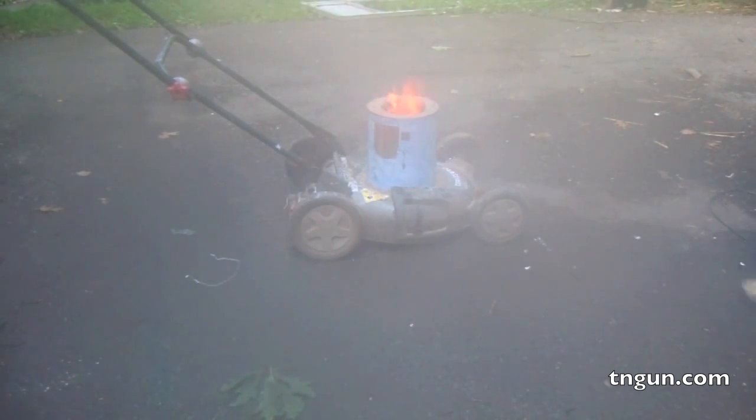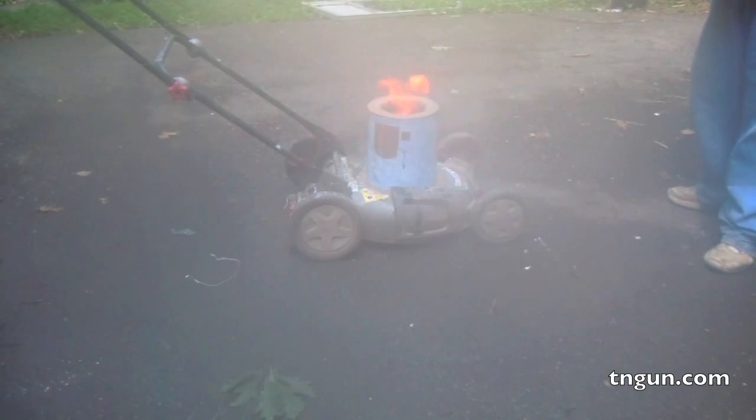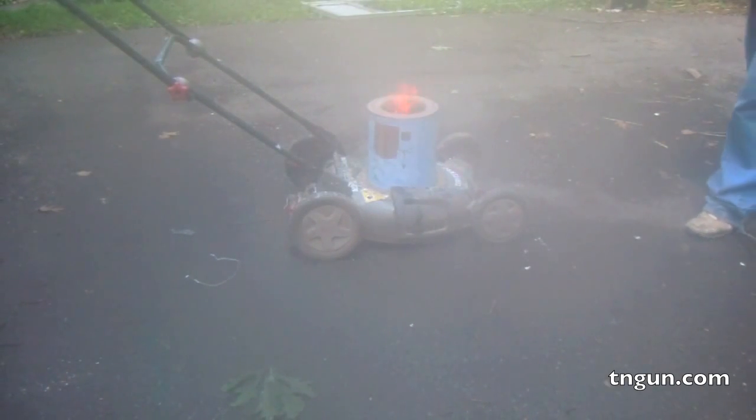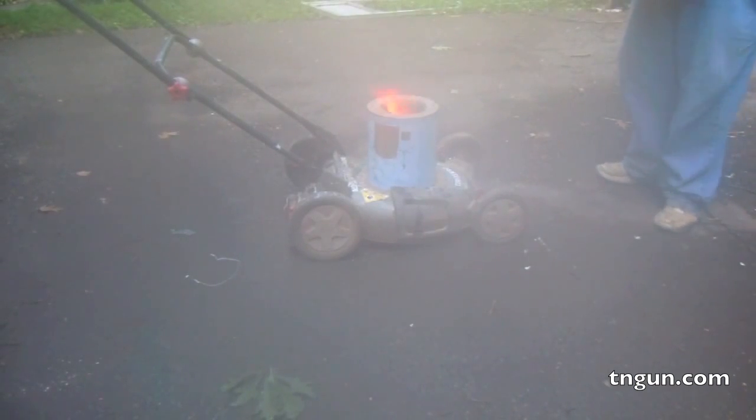Don't want to do the air until we've had time for it to heat up, cause we don't wanna get super hot before we melt out, or vaporize some of that water. Cause otherwise it'll just crack and shatter. If you've ever put a pond rock in a fire and had it explode, that's the reason that we're doing this in stages. So we'll come back after that's burned out a little bit, and show you what it looks like as we put some more in there.